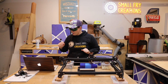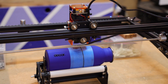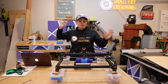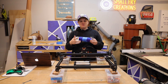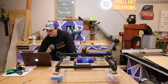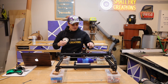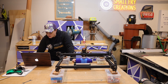I'll pop on my safety glasses and press Start. I also have a fan going and the roller door to my right open so fumes are being blown out. Something I noticed in that test is that it was going round way too many times — it did way more than one rotation. I've worked out what that is: in my rotary setup I had millimetres per rotation set to 360. I'm going to change that to 20.04, which is the same value as the Louisiana Hobby Guy uses, and rerun the test to see if that works.